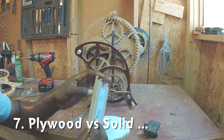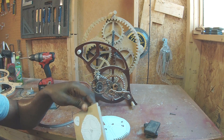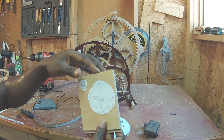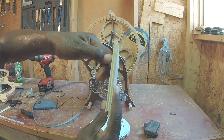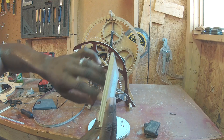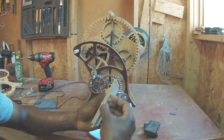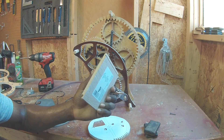Looking at the thickness: I like using plywood because it's more stable than solid wood and it'll contract and expand less throughout the seasons. But even more important than that is the thickness of the top layer. What you're looking at is a sample piece of hardwood flooring, and this is actually what many of the gears are made out of — primarily because that top layer is much thicker than what you can buy from the plywood aisle. That gives you a much thicker top layer and therefore you don't get all the chip-out and splintering. Hardwood flooring worked well for me, but you can order material online — just make sure that top layer is nice and thick.